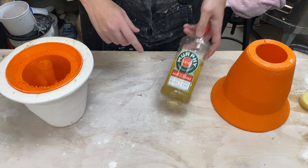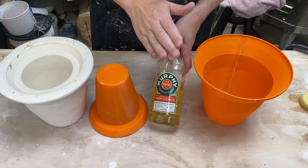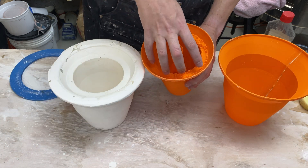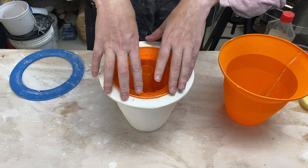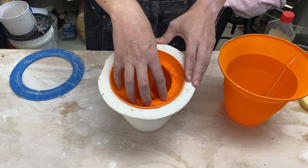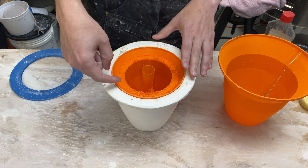So what were some of the ideas suggested? One was to use mold soap. I actually did this — I went ahead and put a coating on the outside of the inner mold and the inside of the outer mold. I'm going to go ahead and put a few more coats on; building up a thicker film of the soap on the 3D prints might be more beneficial. The next idea was to actually try and shrink the inner mold. When the plaster is poured around the plastic there's a very tight seal and we need to somehow break that. The idea was to make this inner mold very cold and ideally it would shrink — most things shrink when they get cold — so hopefully the plastic would pull away enough that we can get air into the sides and push it out.